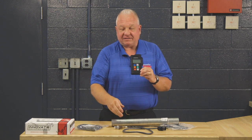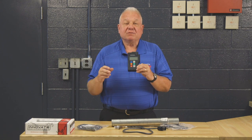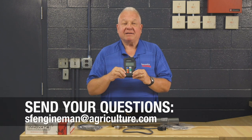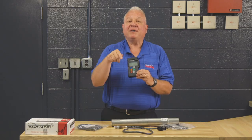If you take the oxygen sensor back out, they give you a plug for the bung and nobody knows the wiser. You would be able to have that tractor running like it was meant to run on today's modern gasoline. So have a blessed day, and I want to see these tractors with the air fuel ratio being checked with a meter.